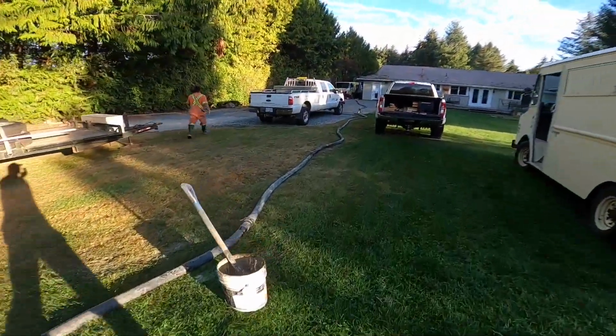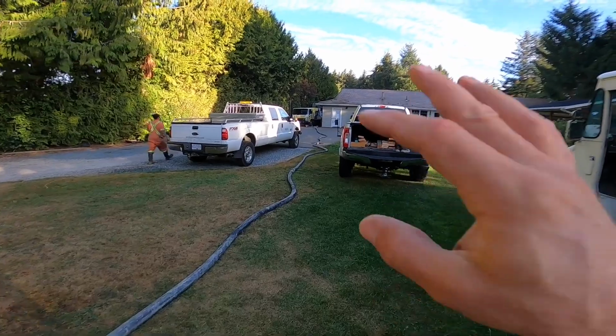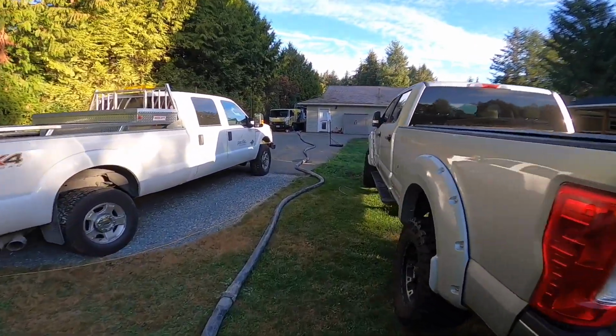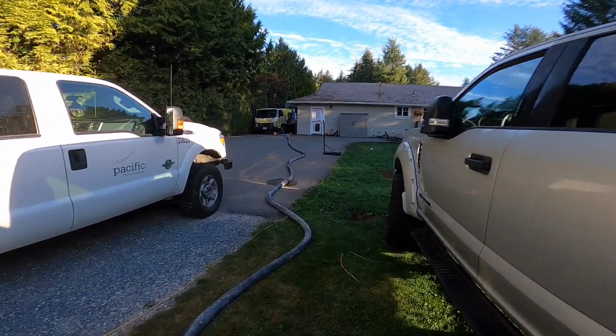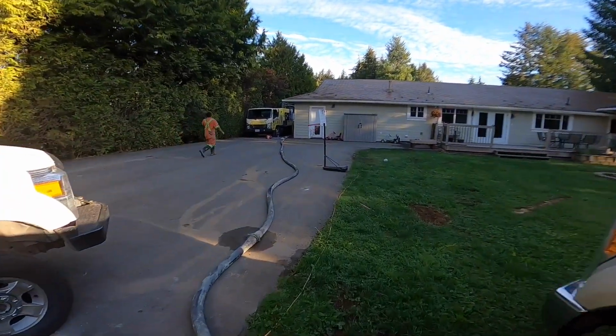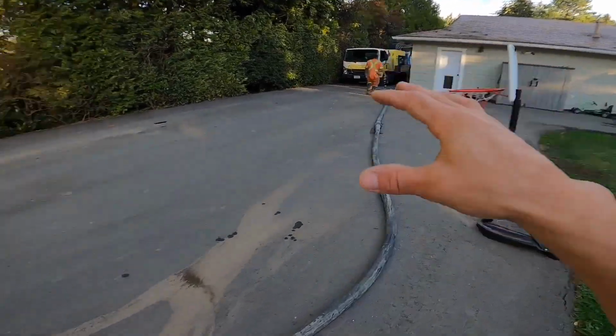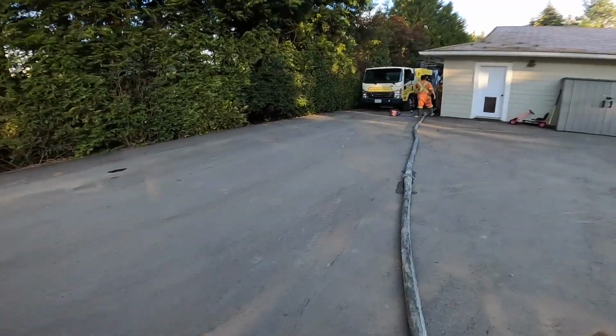Okay, so Ian's gonna go back. We're at about a 110 slump right now, 110, 120. We're gonna take it to a 150. We don't wanna go too wet with this stuff. It's a little bit rocky. Once again, don't wanna get into segregation issues, so we're gonna make it just a little bit wetter and push it through the hose at a nice 150 slump. That's the plan here.